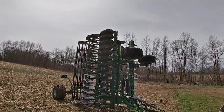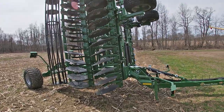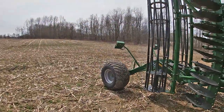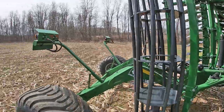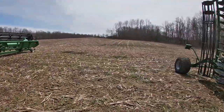Here is the new disc they just delivered. It's very similar to my Pottinger as far as setting your depths and all that. A little bit different - this has front guide wheels where my Pottinger didn't. My Pottinger raised and lowered on the crumbler, and boy this is one heck of a meaty crumbler. This one actually raises and lowers on the tires, which I like better because when turning sharp at the ends of fields on the Pottinger it was putting a lot of pressure on the crumbler bearings. The 8295 goes on that and we disc corn stalks.